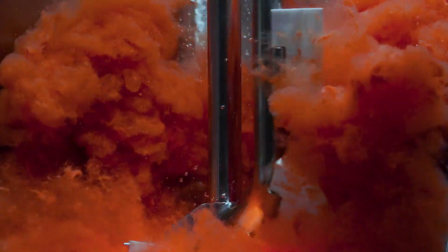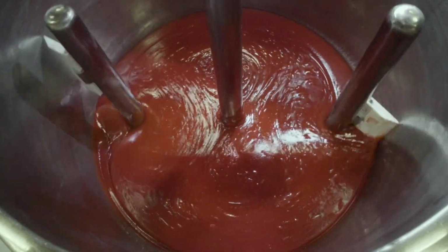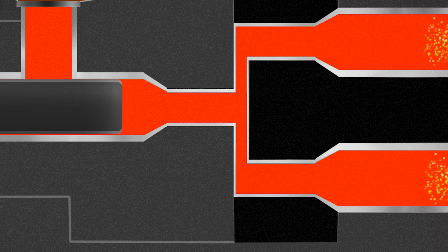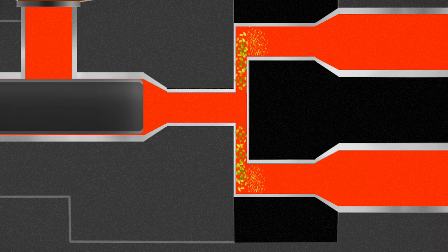After the ingredients have been blended together, the manufacturing process continues in one of two ways. With one method, the mixture is passed through a high-pressure homogenizer. This activates the thickening effect of the pectin, increasing viscosity and ensuring stability, as this operation prevents any free water in the product from separating from the ketchup.